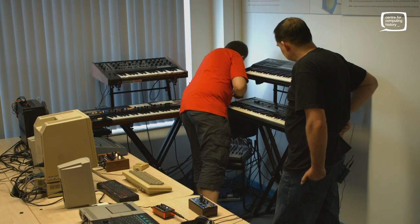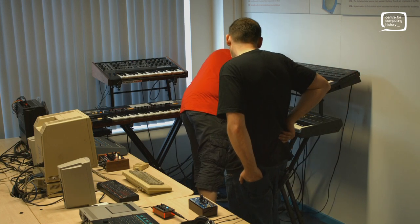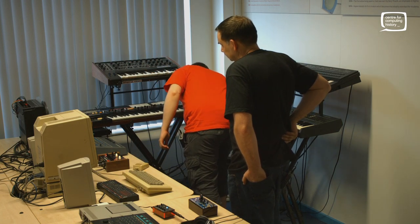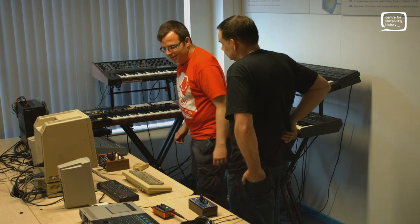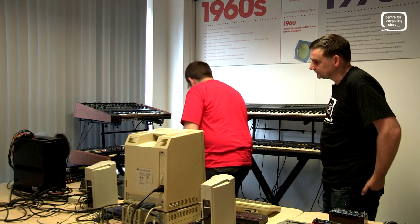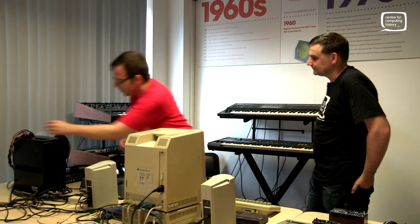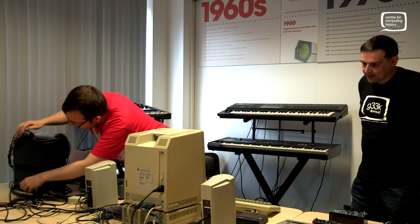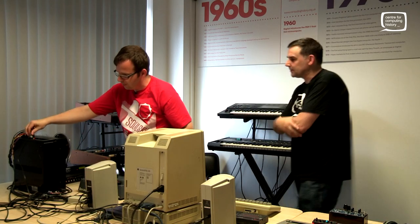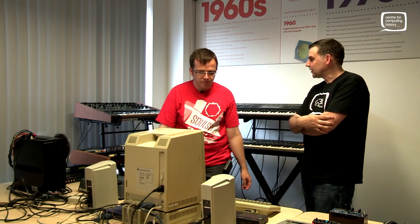I'll give you a little blast of what it sounds like on the tape. It's not the nicest sound in the world. It's on track eight I think. So that is the MIDI signal that's on that channel. It's an eight-channel recorder, so you've got one channel that has gone for this AFSK code — not timecode but the AFS code. So I've got seven channels left — seven channels you can record your audio on.